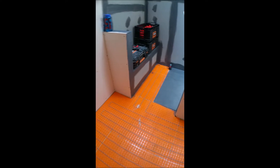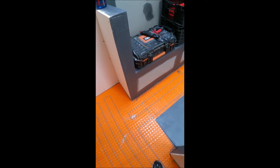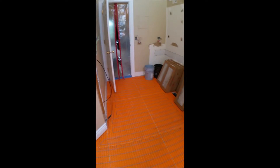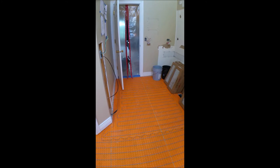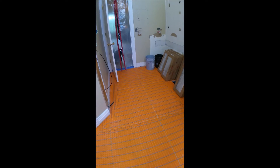Got a laser set up, and as we were setting up the laser I noticed our layout is coming right in the middle — we'll have a grout line right in the middle of this entryway, which is almost dead center of this door. I'd say I'm a genius tiler who set that up, but it just happened to work out that way. We put a couple of cans: the one closest to me is a can-fan combo and the other is a regular can light. That's how we do it at TNT — line it up with the can lights, doorways, and thresholds to the shower.